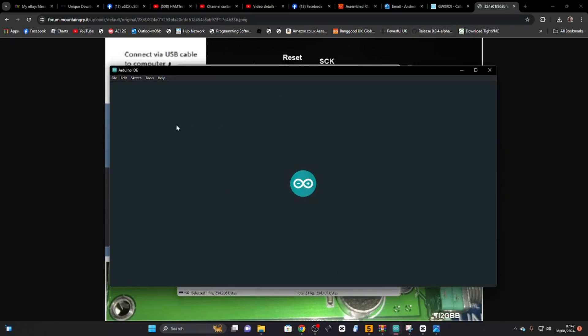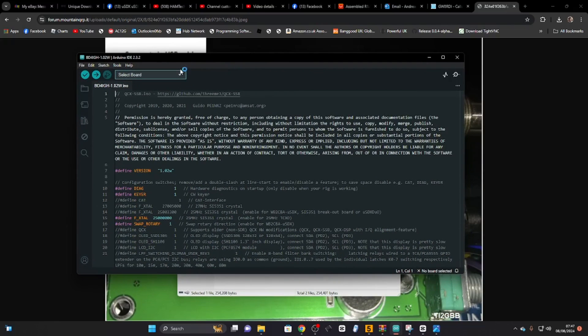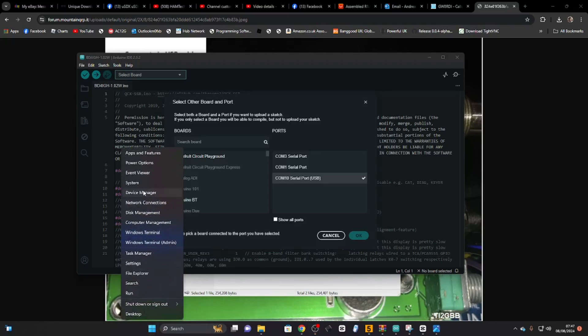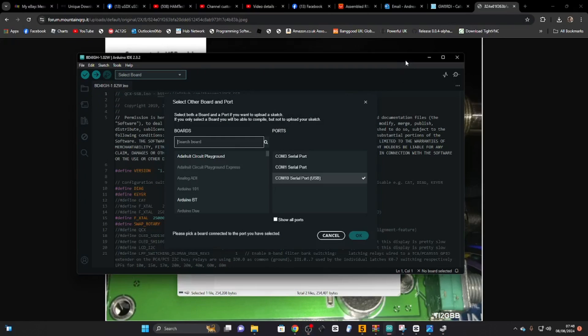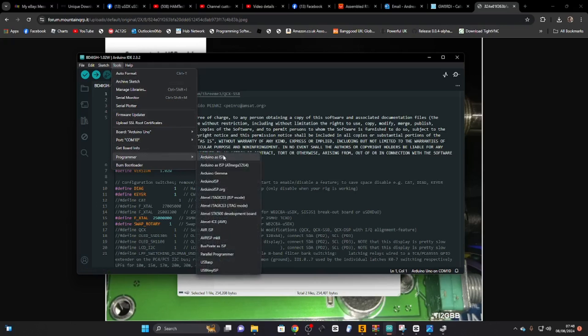While I'm just going to send it in, I haven't actually spent time on this — I'll make a separate video. You'd select your board; I'm on COM 10. Right-click Device Manager and just get your COM number — it's COM 10 just there. Select that; it's an Arduino UNO board that we're using. It's quite a long list. Click OK, then check — go to Programmer and make sure it's set to Arduino ISP.